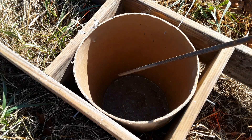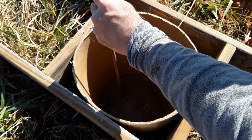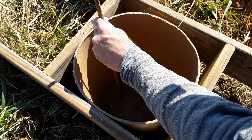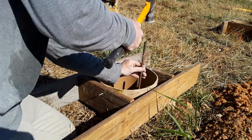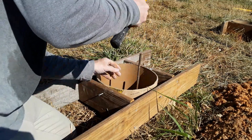I'm using four pieces of half-inch rebar. They are a little bit longer than the hole, so I'm driving them on down into the hole — this will just make the concrete stronger so it doesn't crack on you. If you put a little bit of concrete in the bottom of the hole first, it will make this process easier because the rebar won't vibrate on you.